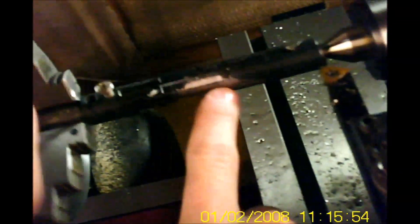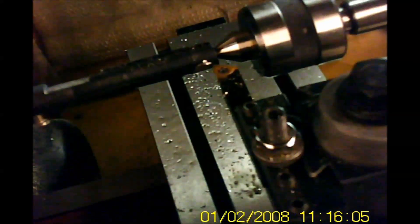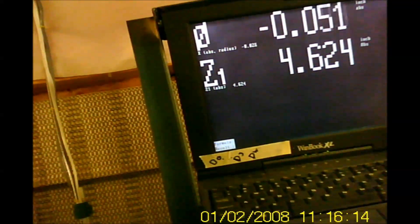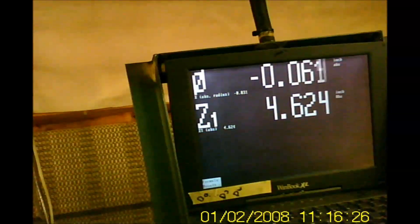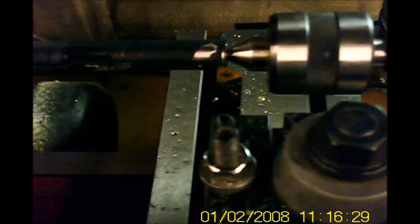I think I'm done in the center section and it looks like I've got pretty good fusion into the base metal, so that should be pretty decently strong — at least that's my hope. I took a little more finish off than I wanted to, but it's going to need to be refinished no matter what. Now I do want to take some more off of this end and get rid of this bump, so let's take another 10 thousandths off, go a little further — 15, 20.